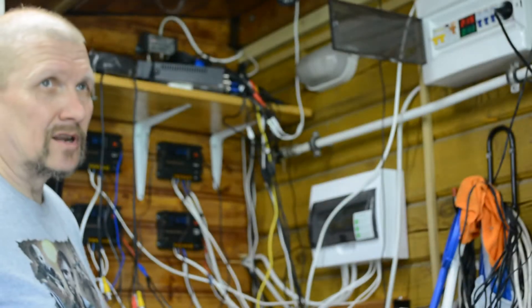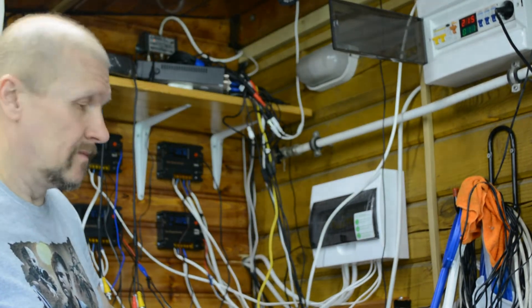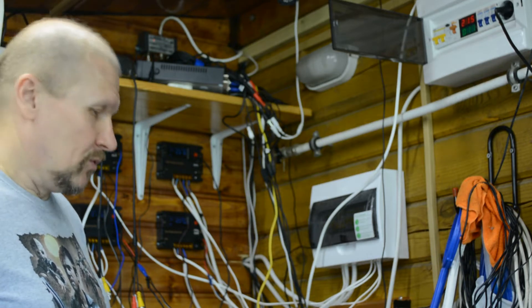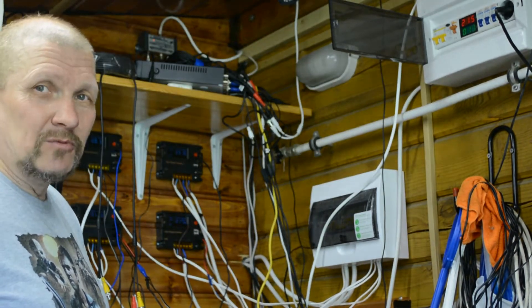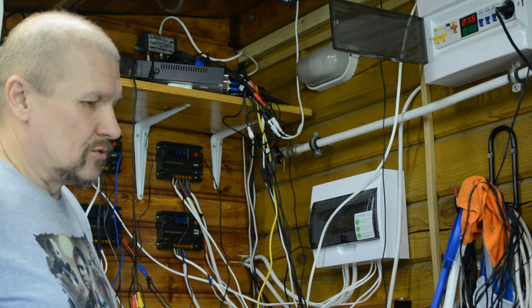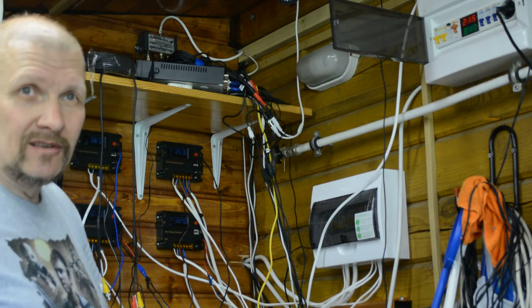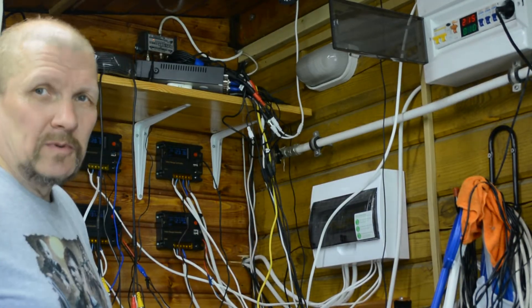On a sunny day this allows us to be completely independent from the grid voltage coming from the city. But I'll say right away: 1 kilowatt of solar panels is really quite little. On a sunny day it's enough, but in winter output drops by about ten times, so you really can't power much. For a property I think you need a minimum of 5 to 10 kilowatts, because around December there can be a whole month with no sun, short days, and the batteries simply don't have time to charge.